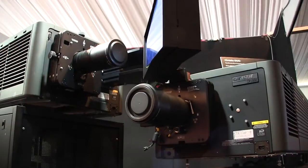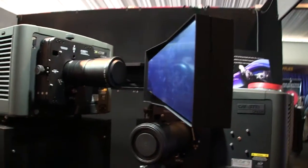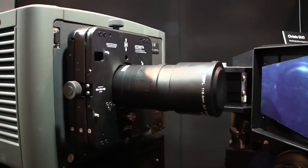My first question is: why do this over just doing normal double-ganging, with one projector on top of the other? Having one projector reflecting off the mirror gives you the opportunity to adjust the optics of that second image to perfectly match the first. It also allows you to get the two lenses and the two images closer together optically, so they're easier to converge on screen. When you're doing a double-stack 2D, the images need to overlap perfectly across the entire screen. It's easy to get the middle to converge, but getting all four corners to also converge can be quite difficult — and with all the adjustments on the mirror, you can adjust the image to fit perfectly.